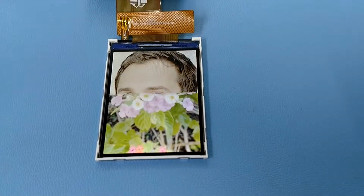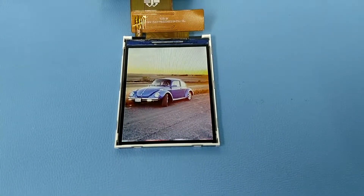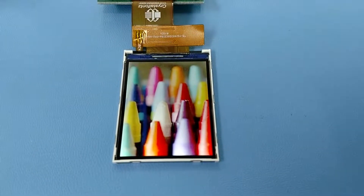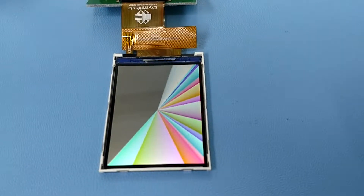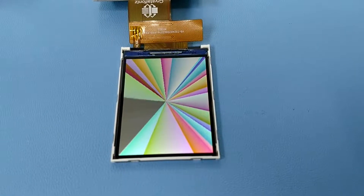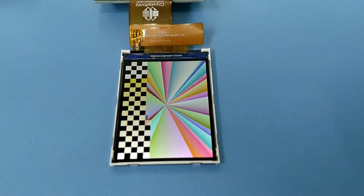This display has multiple interfaces. It has a 3-wire SPI, which uses a 9-bit word — that's a little clumsy on most microcontrollers. It also has a 4-wire SPI that uses an 8-bit word, and that's typically what's used in SPI mode.